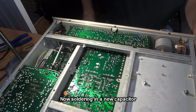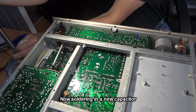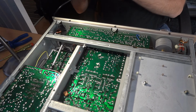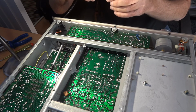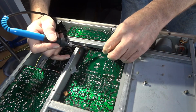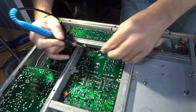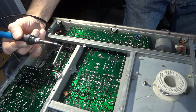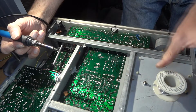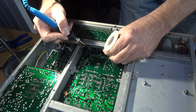Okay, right, I pushed it in there. Just make sure, double check. You always just double check that you put it in the right way round before actually soldering, and especially before turning on. Like I say, just take a picture of what it looked like first of all, and what you end up doing, and then you compare them. So what I'm going to do is just solder this first one first, like that. And now I can pull this one straighter where I've bent them both over to keep in position. I do like to have the pins straight as many as I can.